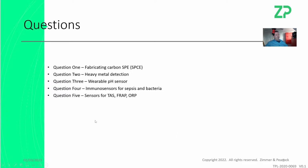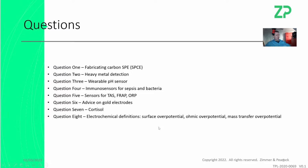We'll also talk about TAS, FRAP, and ORP, oxidation reduction potential. I will focus on oxidation reduction potential today. It's probably worth saying that we do cover that quite extensively in our workshops as well. Advice on gold electrodes, and I realize that question 6 and the last question are sort of overlapping, but so many questions came in, we had to quickly put together slides. We will talk about cortisol sensors. On cortisol sensors, I'll talk about the value of this sensor. Also, question number 8, this one came through YouTube, and it's about the definition of surface overpotential, ohmic overpotential, and mass transfer overpotential.